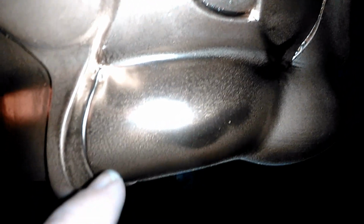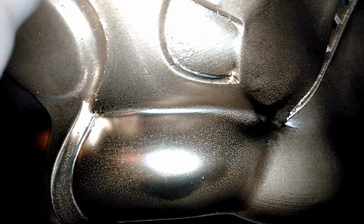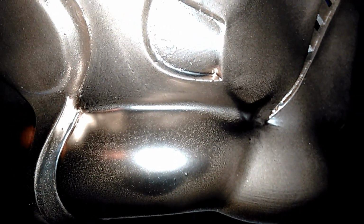So I take this and I put it in the sink. I get a 220 grit sandpaper and I start to sand this. And it seems like when you spray this on, especially parts like this, the silver flakes go into the 3D filament lines, and it takes way less wet sanding to get it smooth than I've ever had with primer filler.